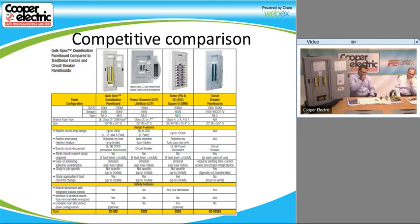And if you look at some of the fusible options from the traditional breaker houses like GE, Square D, or Eaton, they can sometimes be wider depending on what type of fuses and what amp rating all the circuits are at. And they certainly don't have a fusible design like ours that would have 42 circuits in it. It's just not what they designed and not what they built. So our solution is a lot more flexible than those solutions. You can use it for many more circuits. It's much smaller, and it's even cost effective, I think, in certain situations.